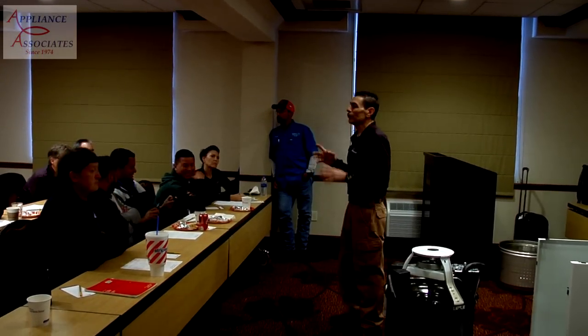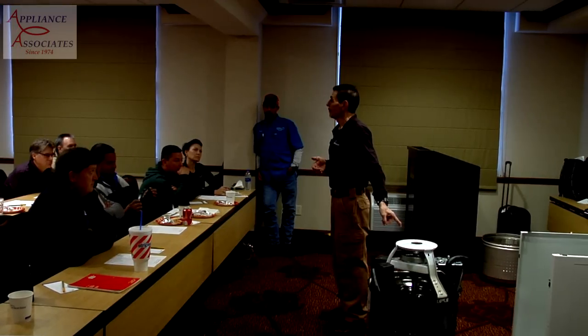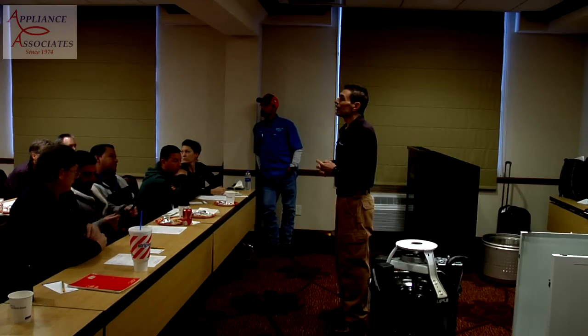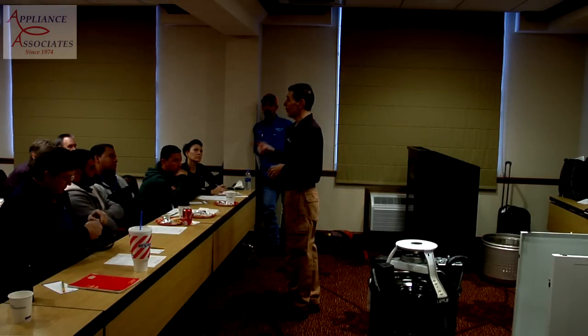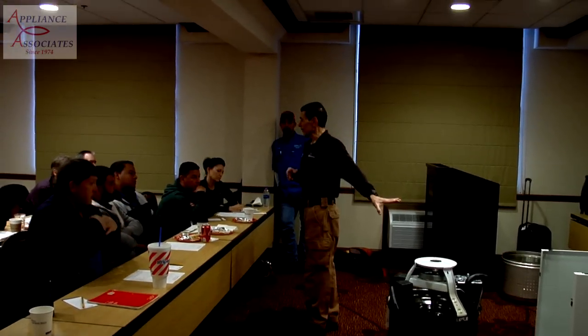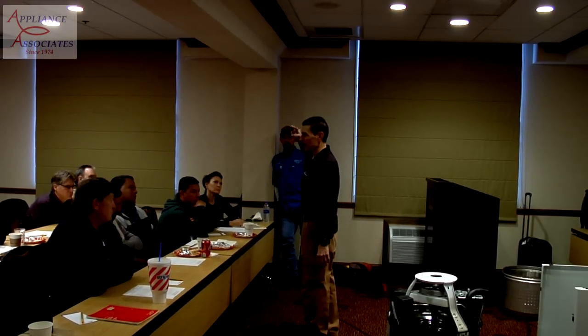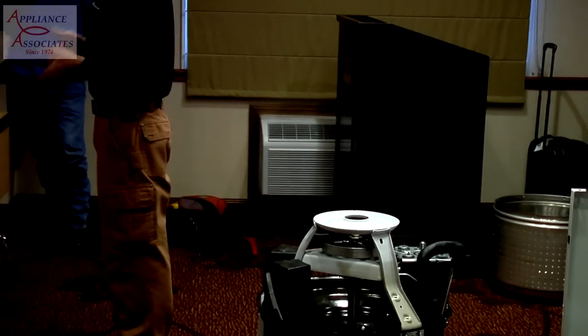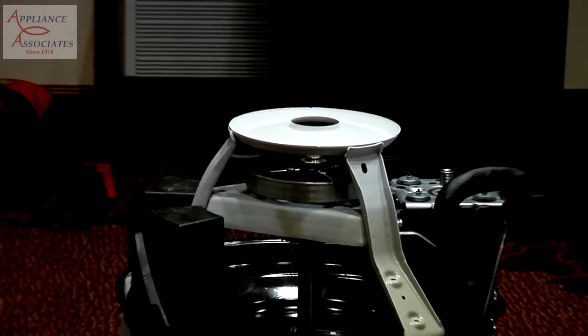So what you're doing is you're looking for, hey, maybe the belt stretched, which is very possible with this. Are there symptoms that go along with the stretch belt, like spin is fast or something? Yes, exactly. You're going to have something go on, maybe even error codes. Now the error codes on the digital will be E1 through whatever they decide. On this machine, it will flash lights that are on the front panel in a certain pattern and a certain rate. So when that happens, you're going to have a legend that tells you what is it, where is it, and what do we do for it. The reason for that is we're trying to help with diagnostics because we understand it's a little different, so until people become comfortable with it, we want to get this information out.